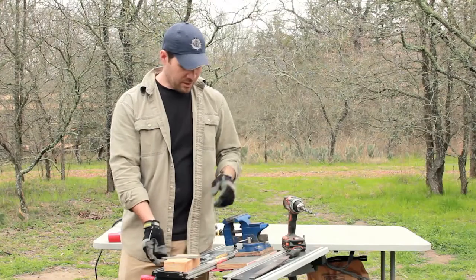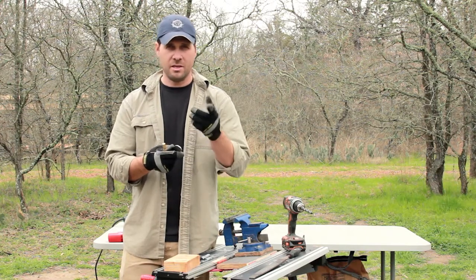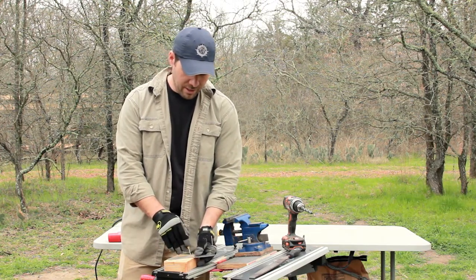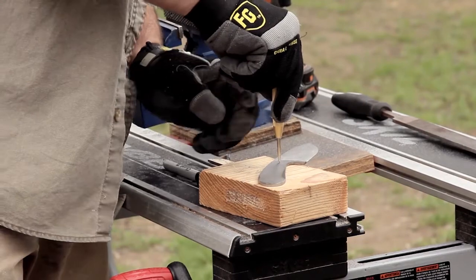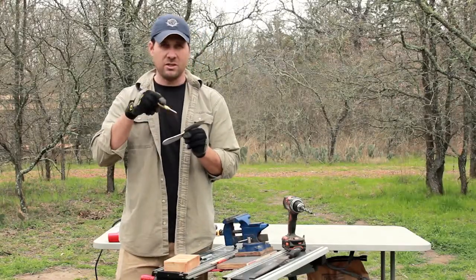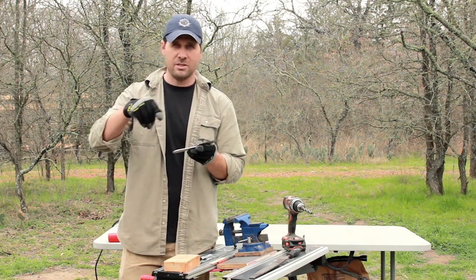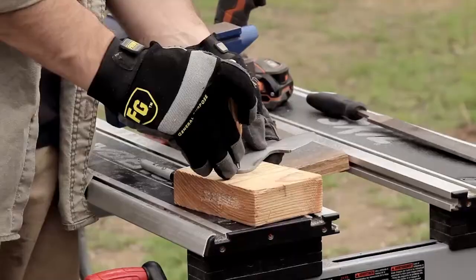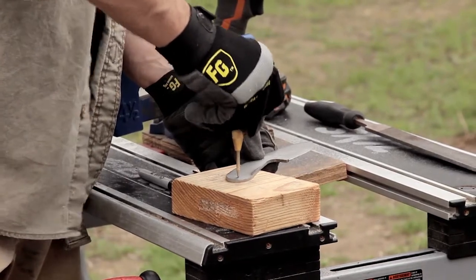But anyway, this is where the spring-loaded center punch comes in. Again, if you want to put some kind of a wood handle or something on here, get the Blade Master course, and I talk about that more there. But really we're just putting the most basic type of handle on this guy. So I like the spring-loaded punches because it's simple. You just get it where you want it, push down a couple of times. That's going to leave a little dent there, and that's where my drill bit's going to start. If you don't punch it with something, even if you use a manual punch, otherwise that drill bit's going to want to slide around on the metal, and even if it does eventually drill in, it may not drill in the spot that you really want it to. So this one I'm going to put right here.